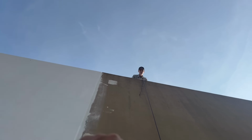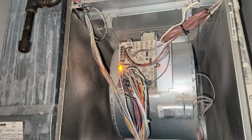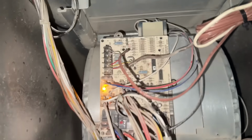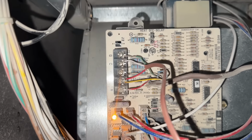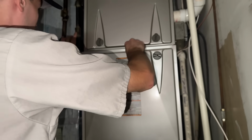Check the resistance on the contactor though before we proceed. Just imagine we have like a bad 24 volt coil in this contactor and we zap ourselves in the process. That won't be too good. We got the new brown wire. I ran across through the door to Y in common. Brown wire, a little extra slack in case someone's gonna permanently hook this up, but yeah, you just might as well do that.